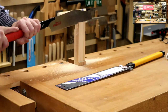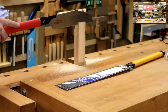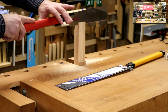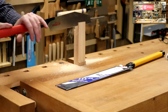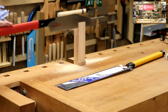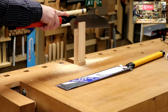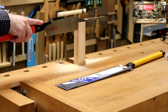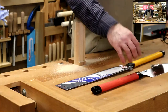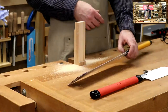But definitely, this left hand, actually releasing pressure. Back on. Release. Back on. That's so important. We'll go one hand. That will cut. I prefer to go one hand, fingertip up on there. And I lift a little bit as I feed back through, so I'm not running the risk of binding it, catching it, buckling it. Okay? So that's the technique they recommend for hardwood. Come on then, Ben. We'll do it now.